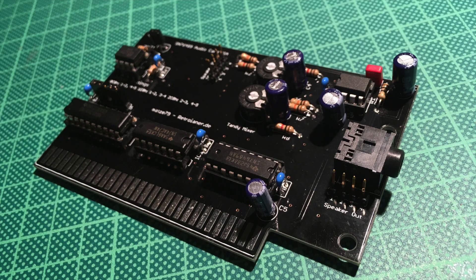The whole card is now finished soldering. I had a few little problems programming the ATtiny, but overcame those because I used the wrong command line for avrdude. Anyway, this is the end result and I think it looks pretty nice — it's still missing a bracket to mount in the PC, but we can use it just fine without it if we are careful.